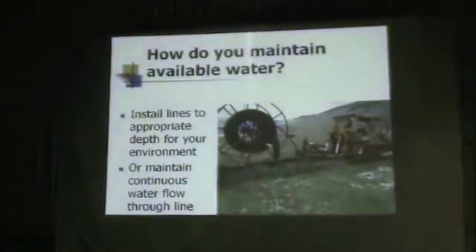Flowing water won't freeze, so we just maintain continuous flow. If you've got a three-gallon-a-minute well, you can't do this. If you have ponds that are dry at the end of summer, you can't do this. Where a system like this works well is if you have springs. If you can do a spring development and maintain continuous flow of water, that is the best way of keeping your tanks and water lines open in the winter — a spring-fed system. That's where we operate in Idaho. In the summertime we pull water right off the irrigation main lines, but in the winter we run off the spring systems.